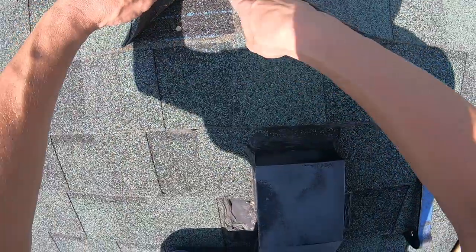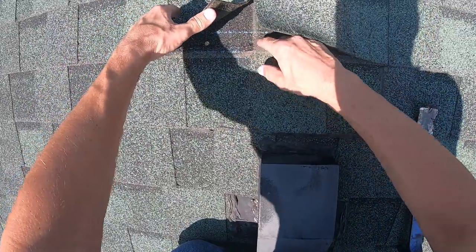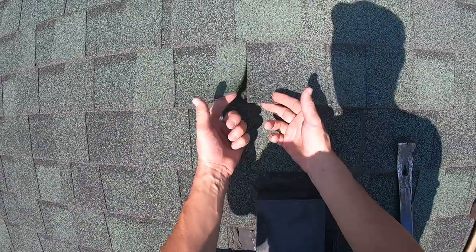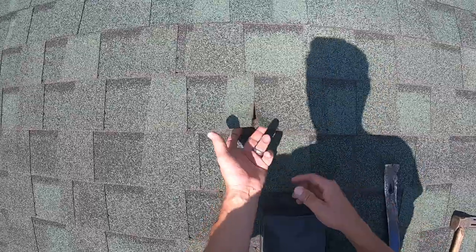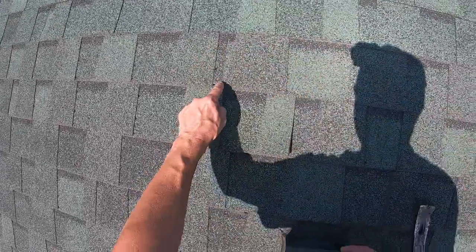See that dirty water trail? Water's going to get into your nail holes, eventually rust them out, and leak around it. So you don't want to put a nail where you anticipate a keyway going — that's an important concept. You also don't want to put one here and then two more right above it. You want to make sure they're offset, like they are here.